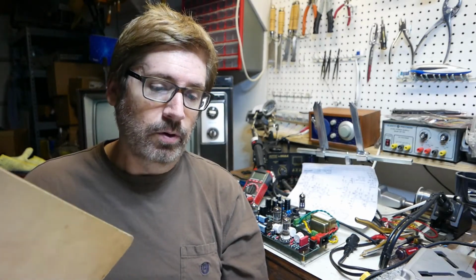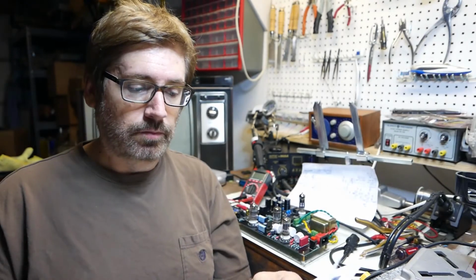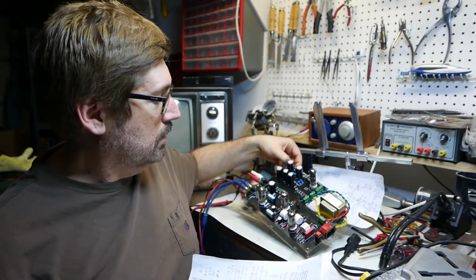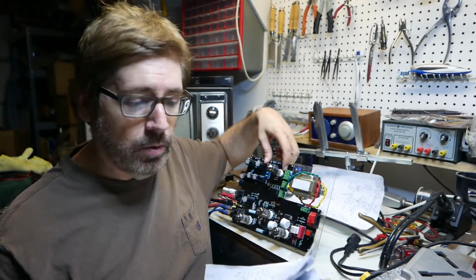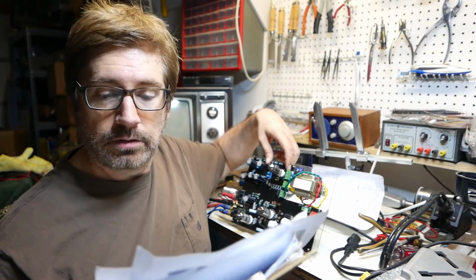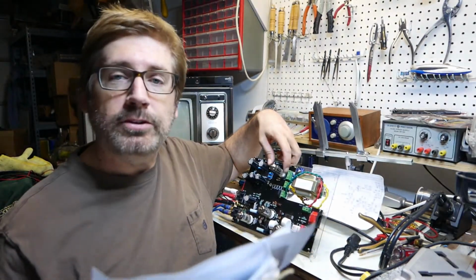So on the power supply, I guess he wants me to measure the power supply again, which I've done a million times. And of course we know that my black blue wires, that's rated at 200 volts. See if I can lift this up. These ones right here, this is rated, it says 200 volts on the board, and I measured 221.4 volts.